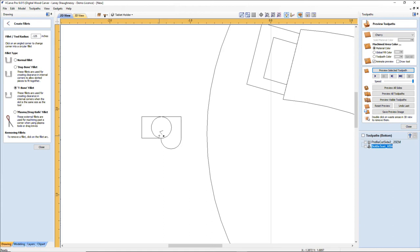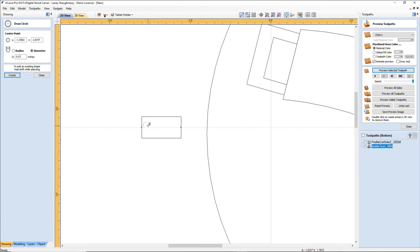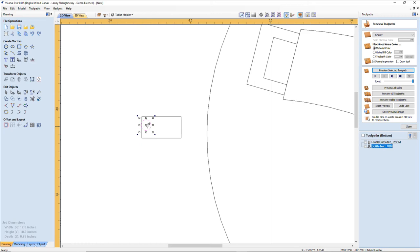So what I'm going to do is I have to use an eighth inch end mill. There's no ifs, ands, or buts about it, because otherwise it's going to be unsightly. It just won't look good. So I'm going to use an eighth inch end mill to cut that pocket out. What that means for me, if I'm using an eighth inch end mill to cut the pocket out, is that I need these two parts to fit together. So I have to use the dog bone fillets now. And my dog bone fillet should still be hidden by that piece that's getting covered.